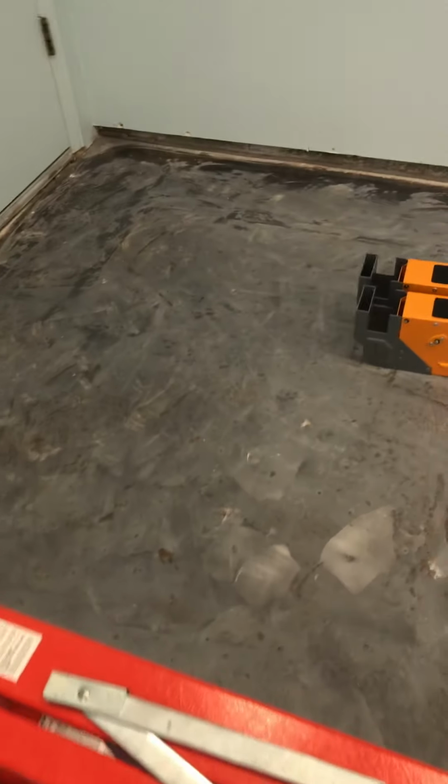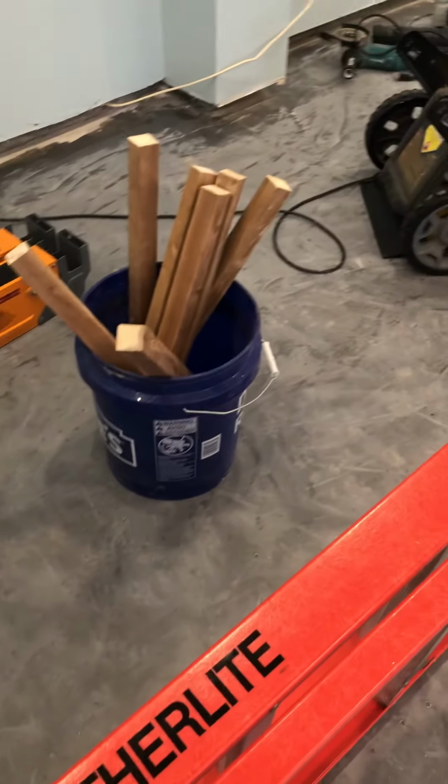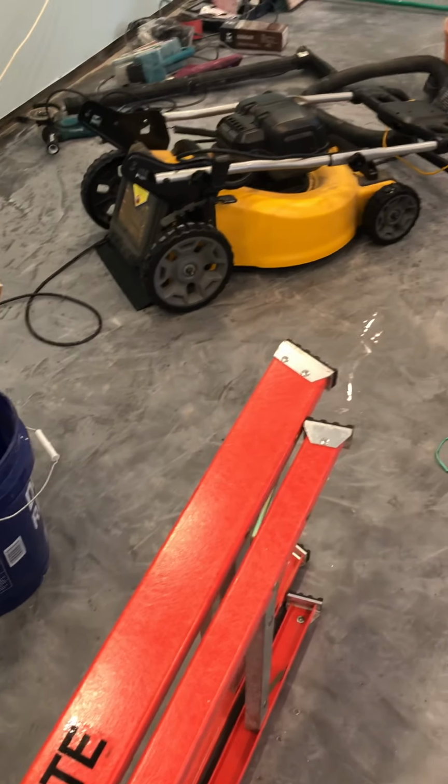The next step after grinding those bubbles like that is to scuff the rest of the concrete and smooth some pieces out. And so I go at it with a belt sander, and you can see the results of belt sanding here. The final step that I haven't taken yet will be to get rid of any shiny spots with a smaller detail sander. You can still see a few bits here and there. And then before I get the right weather conditions, I will wash with acetone, making sure everything's very clean, and then reapply.